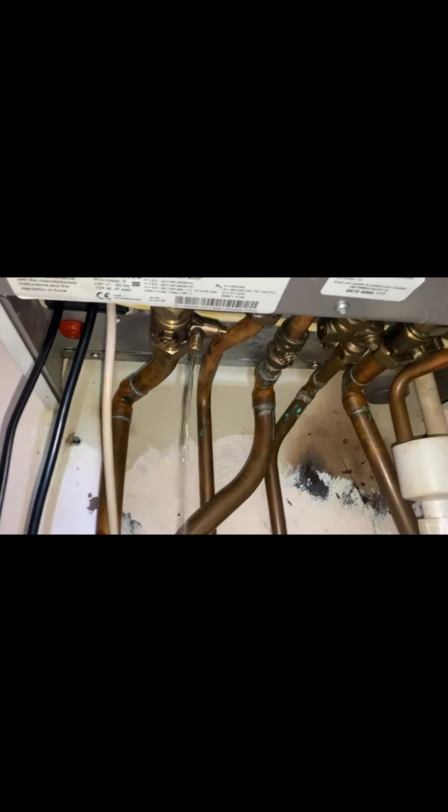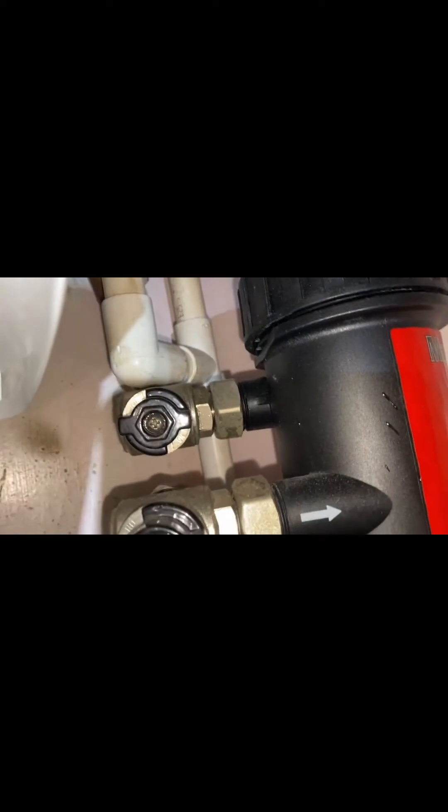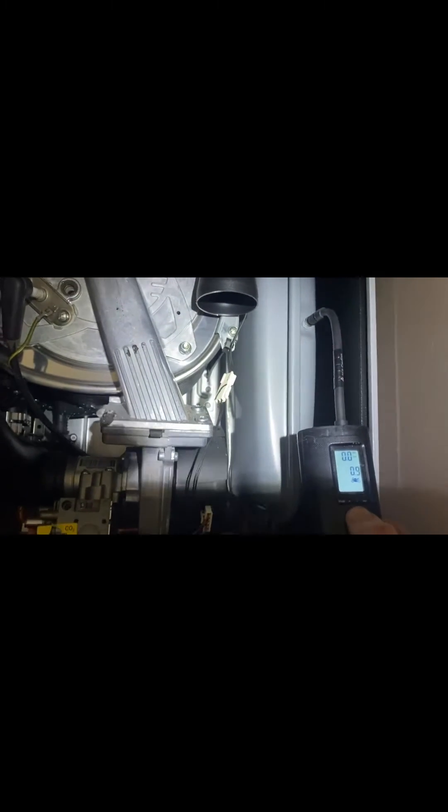We need to drain the boiler - obviously there's water in there, so the water's getting drained off, bucket it underneath. I also take this opportunity just to recharge the expansion vessel, a bit of LBF on the Schrader valve afterwards, make sure it's not leaking, which will just push more water out. You're going to lose a bit more when you take the sensor out, but it just gets rid of the bulk of it.